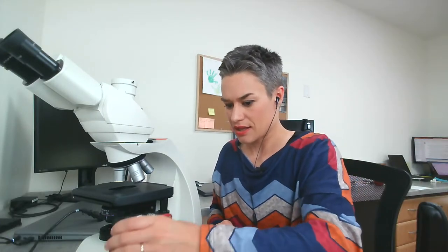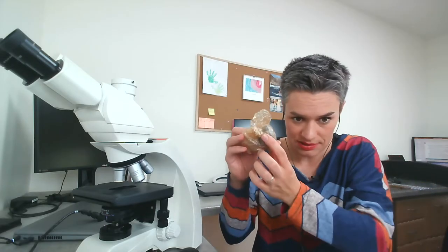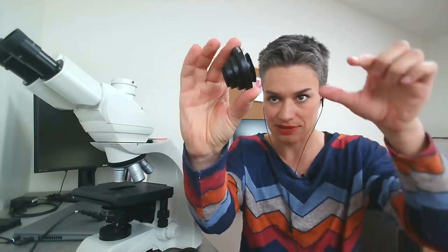Now the easiest step would be to attach the camera and the C-mount first. The camera is the red camera, and the C-mount should be a black piece — that was not in the box; it would have been with the microscope originally. You have a C-mount — that's what it is. So now that you have the cap off and you have the C-mount, one side of it is the threads. If you put that down and pick the camera up, pop the black rubber cap off the bottom — threading is there — and essentially you just screw the C-mount onto the camera. Make sure it's snug.